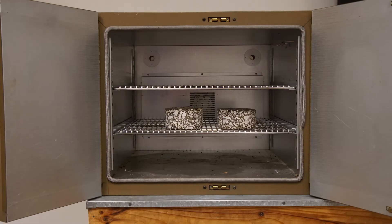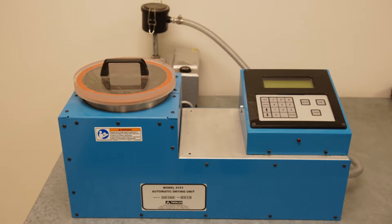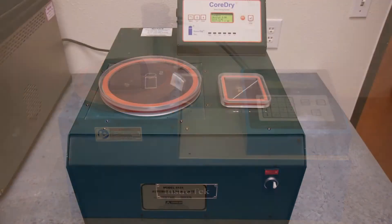For specimens containing moisture, place in an oven with the flat side of the specimen on a flat surface to complete the drying process. Oven dry the specimen for a minimum of 2 hours at a temperature of 115 plus or minus 5 degrees Fahrenheit to a constant weight. As an option, use a core dryer in conjunction with or instead of a drying oven.